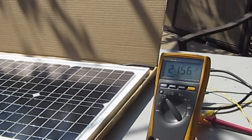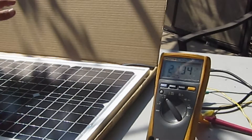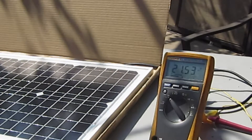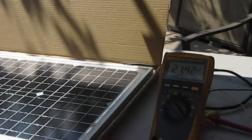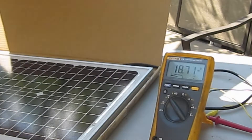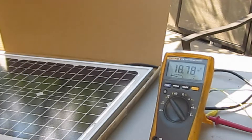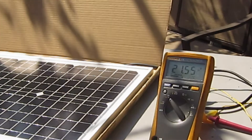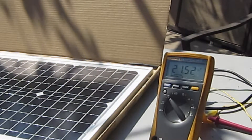Just to make sure that's coming from the solar panel, let's try to put a hand over it and see the voltage drop. We'll put it in the shade — make a shadow over it. Even though it's almost completely shaded from direct sunlight, it's still producing 18 volts. Of course, we don't know how much current is associated with that because we're not drawing any power. Maybe we'll try hooking that up to our battery power modulator and see how much power we're getting out of it.